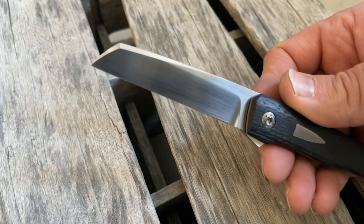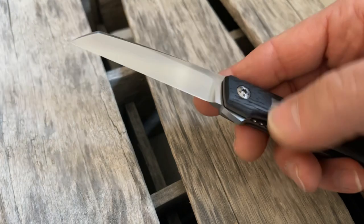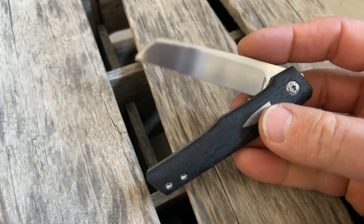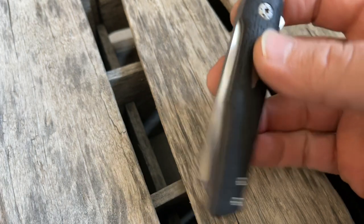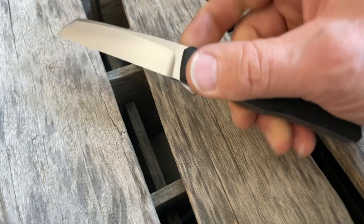Here is that knife with the new steel. Tough to finish on a hand rub — it was a definite workout — but you'll see that as I close this, the detent ball does not quite fall all the way into that hole; it just catches it right here at the end. That is the reason for that offset. It also doesn't drop all the way in there, so you still get a good flipping action when you open it. And there you have it — the secret to the detent ball on my knives, and that's how I do it. I hope you guys enjoyed this episode and watch for more in the future.